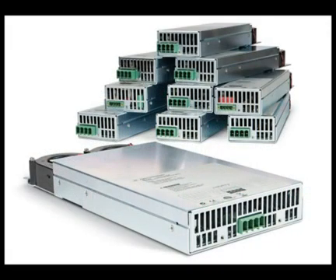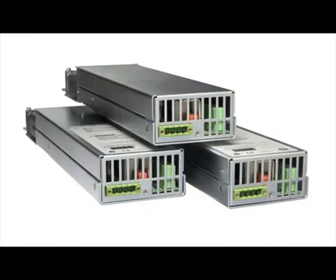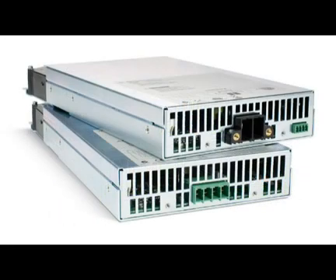Power modules come in a variety of capabilities for high performance, high precision, or basic power applications. A new family of 2 and 4 quadrant source measure modules has also been added. These 50, 100, and 300 watt power supply modules feature fast output slew rate and quick response to programming commands, typically less than 1 millisecond.